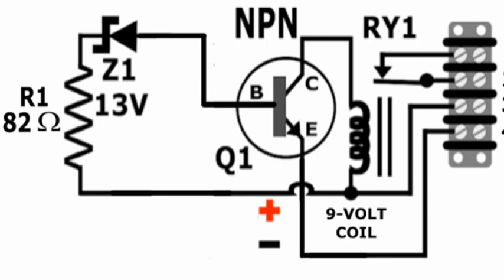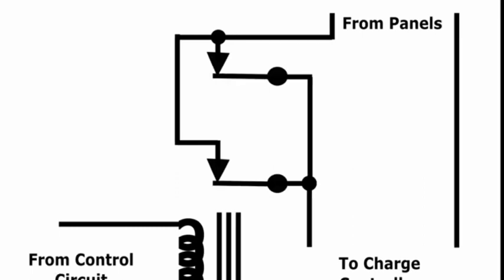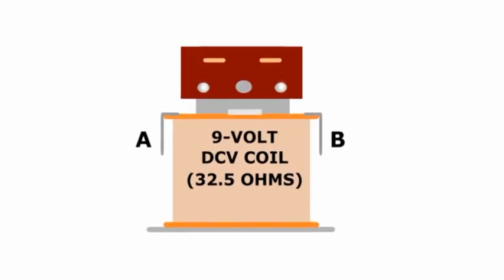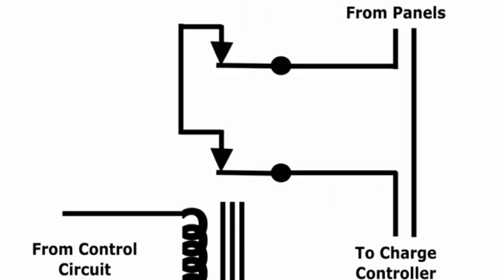with the Zener diode. An advantage of the new relay is that the distance between contacts is almost twice as much as that of the original relay, thus providing more protection against arcs when interrupting the direct current coming from the panels. The replacement relay also has 2 poles, so both poles can be wired in series, thus doubling the distance between contacts whenever they are open. I hope this relay lasts longer.